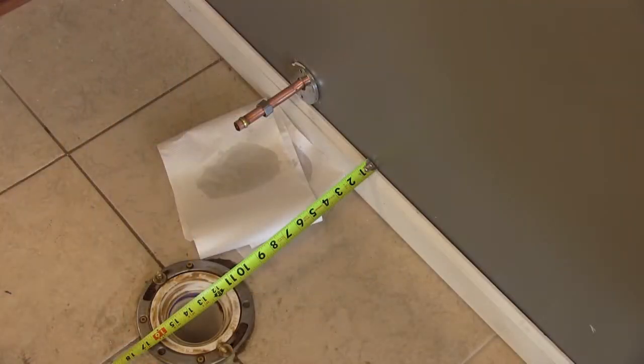What I'm doing here is showing you from the finished wall. I have my tape measure butted up against the drywall, which is the finished wall in this bathroom. I'm showing you the approximate — or exact — location of the center of the flange, or the center of the waste line, however you want to look at it. We've got to make sure, if we're installing a toilet even in new construction, that the flange is the proper distance away from the finished wall.